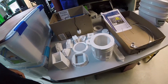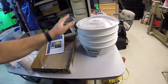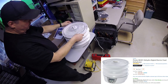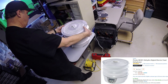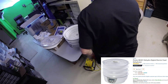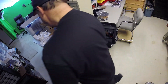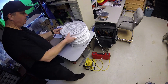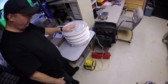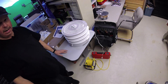I've got an R2-D2 project going on with some small parts. Good to have a food dehydrator — you've got to have that. What I did was take the center out so that a spool will fit in there. Carbon fiber and nylon both suck up moisture, so if you're having trouble with them, you put the spool in here for six, eight, or ten hours at 160 or 140 degrees Fahrenheit, whatever you prefer, and you dry it out.